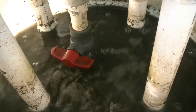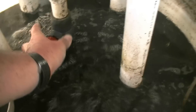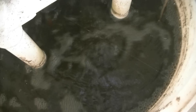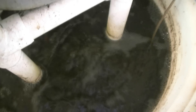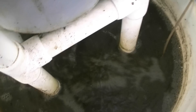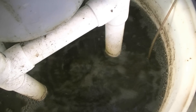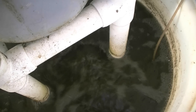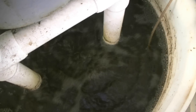We've now taken the water out of the system. We're going to dump the water in the hydroclone - simply just by turning this handle here, and we run that for a couple of seconds. That's now dumping all the waste into the top there. We've taken the waste material and put it into the mineralisation system, and in this case we're aerating heavily to make sure we don't get any decomposing by anaerobic conditions but more so by aerobic conditions. If we start using anaerobic conditions, we're going to produce anaerobic bacteria and introduce that into our system, which competes with the aerobes. By using aerobic bacteria, we're using the same types of bacteria that break down nitrite and nitrates, and this works more effectively for us without any lag phase.